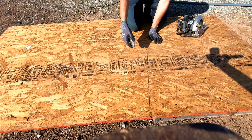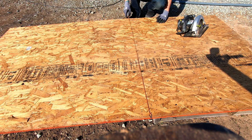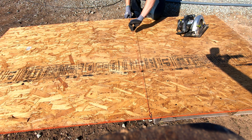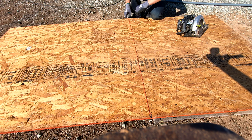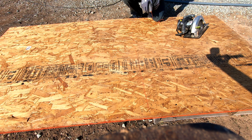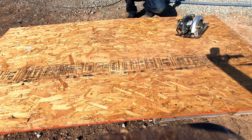I'm going to pull this across and line it up with my mark on the other side. Since I measured equal distance over from both sides, when I snap this the line should be exactly 42 inches all the way across, and then I don't need any framing squares or anything like that which are tricky to use.